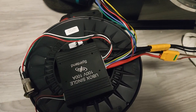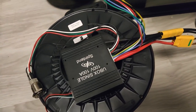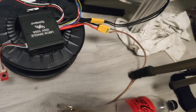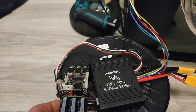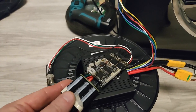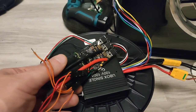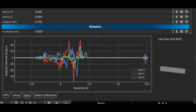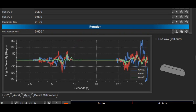The Trampa board was plug and play — I had zero issues with it. I connected the Ninebot motor and everything worked from the start. It is a bit more expensive, but you get what you pay for. The third VESC I configured was the Spintend U-Box single — I didn't have any issues with that one either. What makes it special is that it has an integrated IMU, which is basically a chip with an accelerometer and a gyroscope. I will be needing it for my electric unicycle.